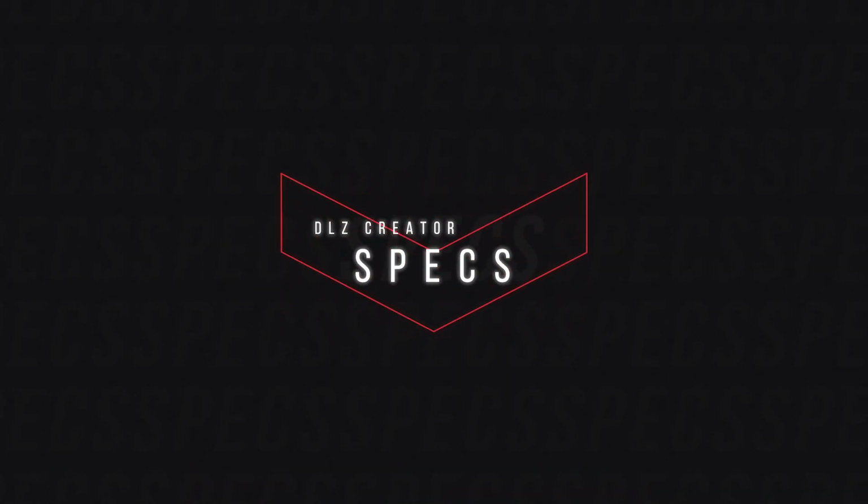Hey, it's your favorite chapter to skip, but before you do that, there are a couple specs that we should note. This thing has 8 inputs, 4 mono and 2 stereo. There are a maximum for multi-track recording at 12 tracks. It has a resolution of 24-bit and 48 kilohertz, an equivalent noise of negative 143.4 dBV A-weighted, which sounds absurd, but when you do the math, it comes out to about negative 130 dBu A-weighted.